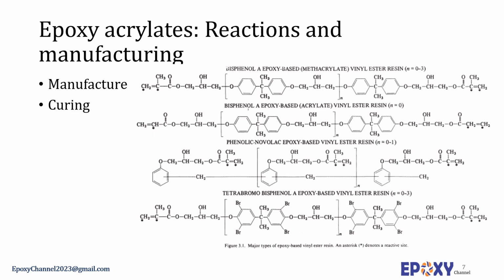In the case of the epoxy, the diglycidyl ether of bisphenol A type is used. The reaction of acid addition to the epoxide ring, esterification, is exothermic and produces a hydroxyl group without the formation of byproducts, as in polyesterification, where water is produced. Appropriate diluents and polymerization inhibitors are added during or after esterification.